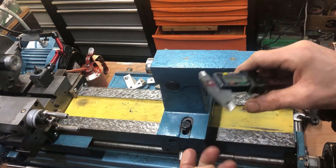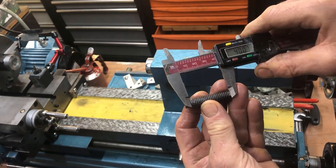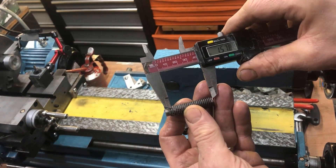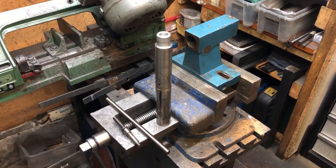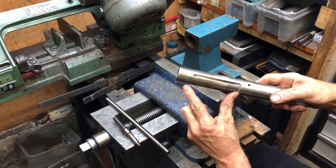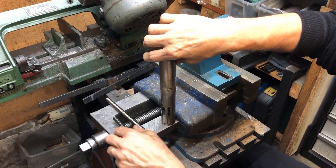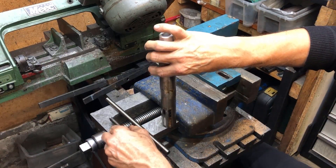The original tailstock travel was a meager four centimeters — at least the length of the screw — so roughly only about an inch and a half. That was far less than ideal, so I decided to modify the tailstock, and one of the things was to lengthen the barrel. To do this, I needed a longer screw, MT3 taper. The markings represent some 50 or 60 millimeters, while the screw was only 40 — far too short travel.